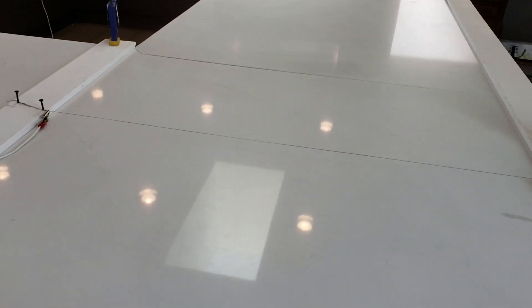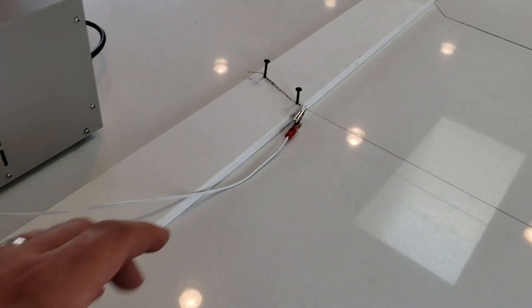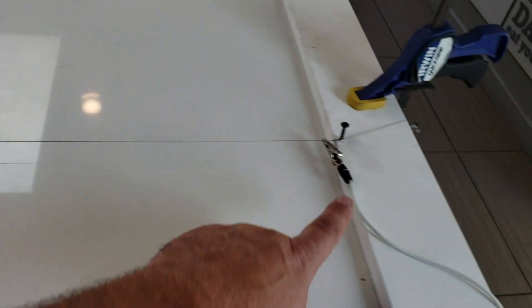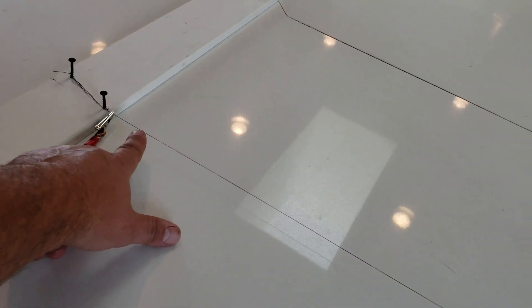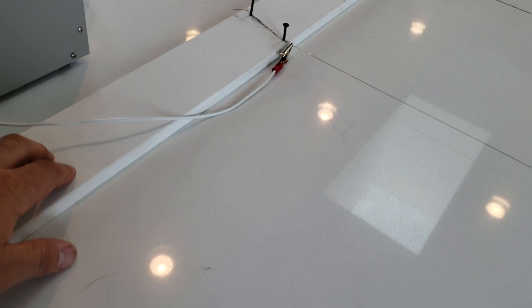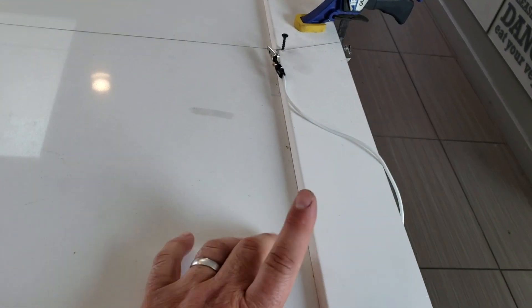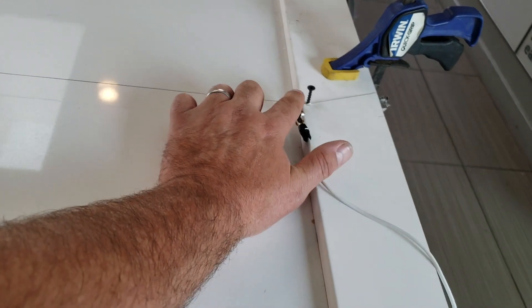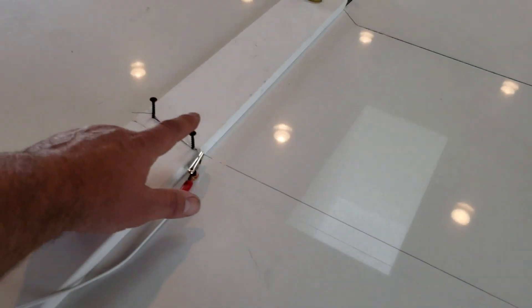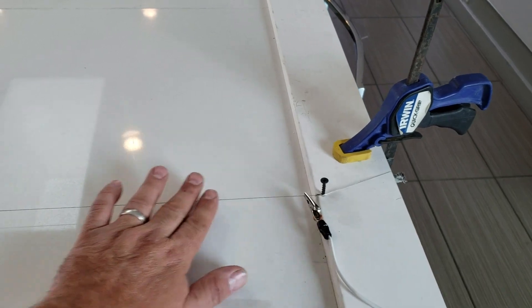Over here on the cutting table — formerly our kitchen counter — we've got the leads. We've got the positive and negative, with the wire stretched across: positive on this side, negative on this side, so the current is going to flow through this wire. This wire is the resistance — that's why it gets hot — and back here to ground. I wanted half-inch sheets out of one inch, so I had some extra base molding from the garage. I set these up — it's a nice half inch — so when I run the foam along here the wire is at the half-inch level and it's just going to cut in at half an inch. A couple of drywall screws here just holding it: this one keeps it from pushing forward and gives tension, and this one the same, so I have a nice straight wire.